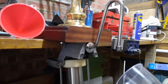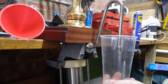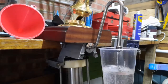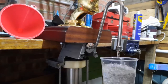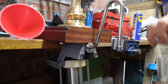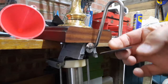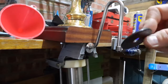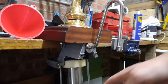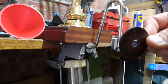Right then, here we go. Perfect. Just by replacing that diaphragm, I now get self-priming on that pump, and I don't have to create a suction here to pull through and fill this chamber first before this pump works. So just by changing that.